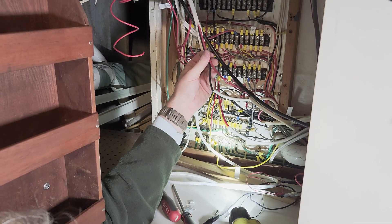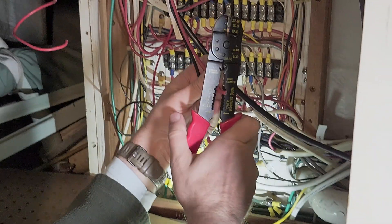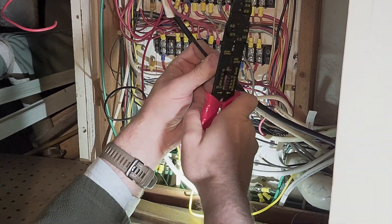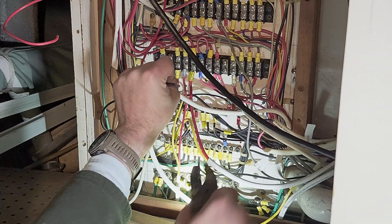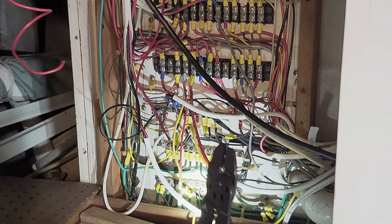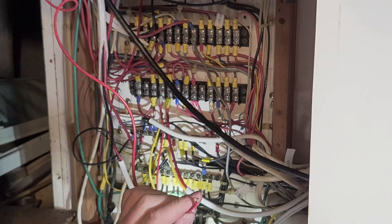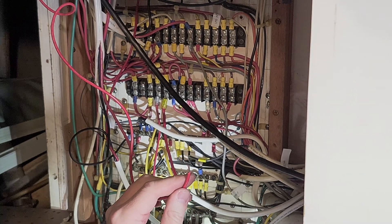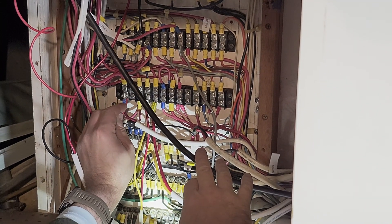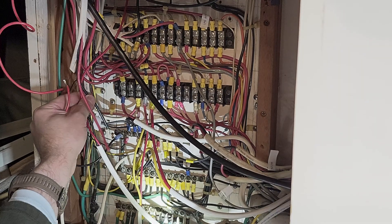This is the connection going into the cockpit and we're going to expose these leads. Now we're going to expose this lead coming from the switch. We're going to crimp all three of these wires with these spade connections, and then we will connect positive to positive on this block, and connect the negative to the negative bus bar down here with these spade connections.